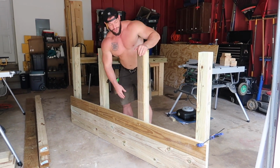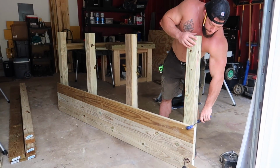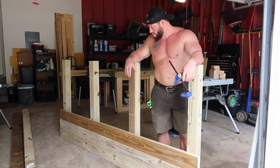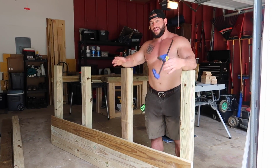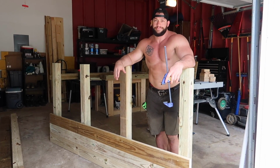So our front facing boards are all secured, just with 1 board each. We clamped, held everything a little square, threw a screw in on each one. Now we're gonna be able to lay it down and get the rest of the screws in. We're gonna move over, start doing the back side, then merge those 2 back sides together, start really forming this thing as a big box.